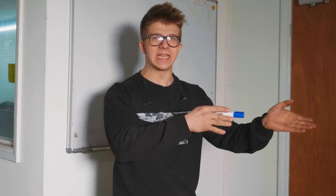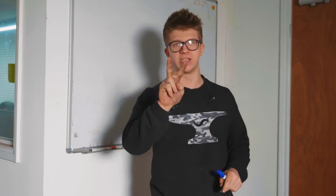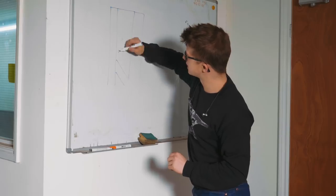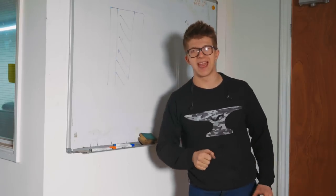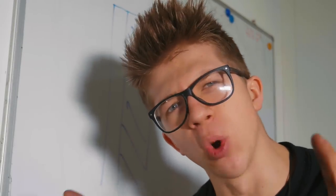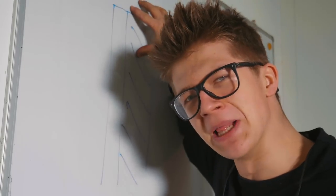So I first wrongly calculated the amount of material that I need to cut off of the 1055 steel, and so I had to cut another piece out, drew it out, that's fine. We've got two pieces of steel on either side of our Damascus. This means that once we weld it together, we're gonna have twisted material here, mono steel running on either side. It's a very large billet right now, which is great because it means we have plenty of material to work with for this gigantic sword, but it also means we have a little extra to get rid of some material up here to try something new. But we're gonna talk about that after we make this forge weld.